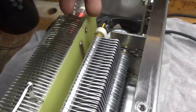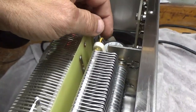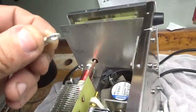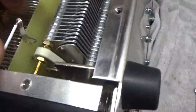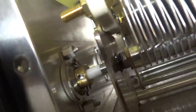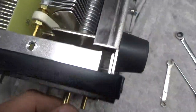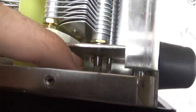This connection right here doesn't make any electrical connection — it's just to give the board support. So I removed the solder and took the nut off and pulled that connection off. It's right here — a 3/8 nut — I'm going to use the 3/8 wrench. Took the nut off over here. Don't forget to loosen the set screws, which are Allen screws for the vernier drive right there, which connects the shaft to the vernier drive. I rotate it counterclockwise to get at the bottom one, then rotate it back so it's fully meshed again, and get at the one pointing straight up.